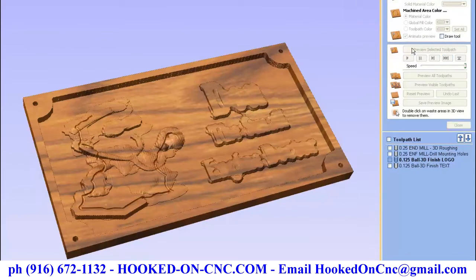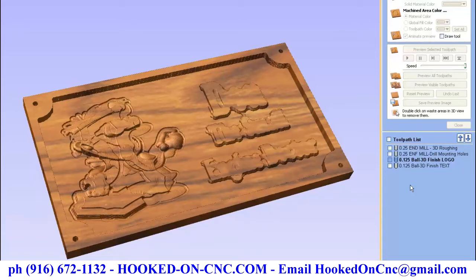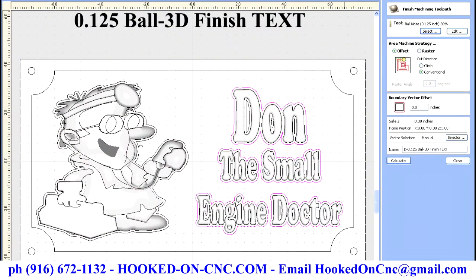Here you see the simulation doing a finished cut on the logo, which tends to travel in a circular path around the image being cut. So if you have a box-shaped image, you end up with tool lines at right angles to one another, and that makes a semi-ugly effect for me. So I try very hard not to have right-angle tool lines on the drawing. That's one reason why I give the rectangle rounded edges, to prevent tool lines angling at 90 degrees.